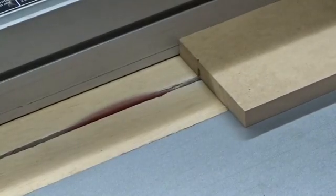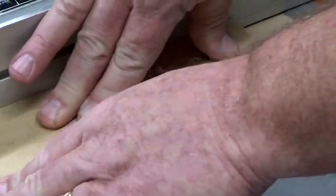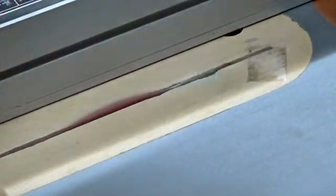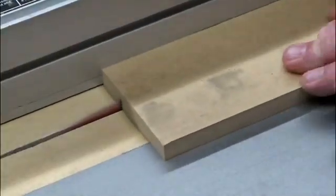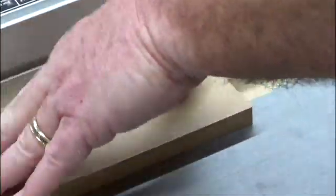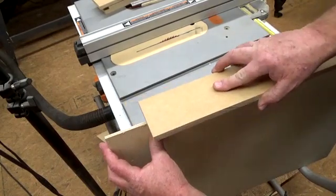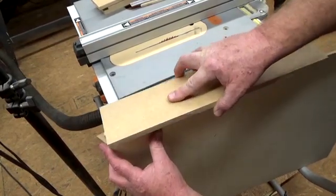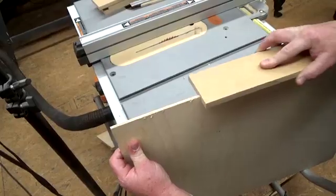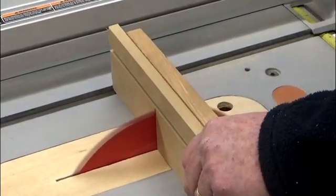Starting to cut some 1/4-inch dados here, two passes of the 1/8-inch saw blade. This will be on the inner side of the box, which will hold a lid about 1 inch from the top. The dados can be cut just a little bit loose. That'll ensure that the lid will slide easy, which looks like I got that done.